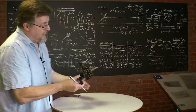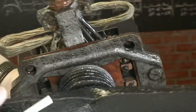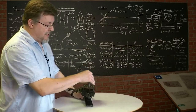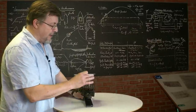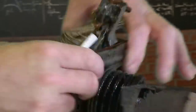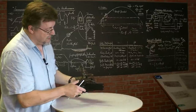Another interesting thing to note is the way it's been mounted. This spring mechanism is no part of the ejection system — it's been mounted on this crossbar to give it a very soft connection, to make sure that everything marries up well and doesn't get pulled during the setting-up process, ensuring everything is self-seating and self-centering. We can also see a very substantial cable tie here to support the cabling on this tongue, and this tongue appears to have broken away from its mooring at the bottom at some point.